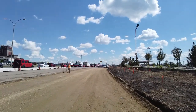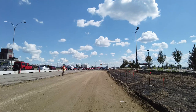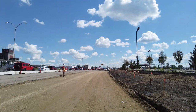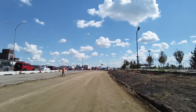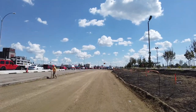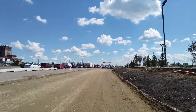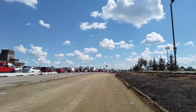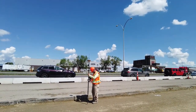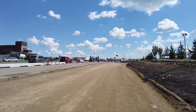Don't take your numbers out right away. Just disregard your numbers for the first little while and get level with the grader. Then once you've got a level area outside these numbers, you can take the numbers. You wouldn't want to be cutting this at over 4%. Darcy, the crossfall here is over 4%, isn't it? 4.6%. You wouldn't want to be cutting this grade at a 4.6% crossfall. You want it level.